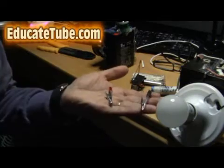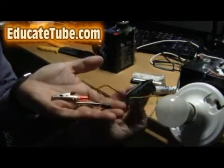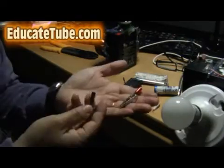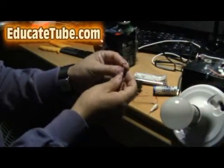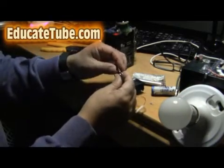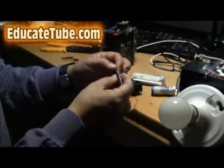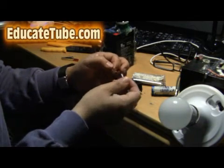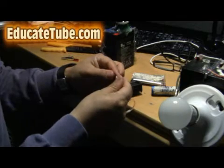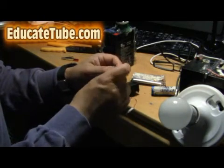So here's the clip terminal that I will provide. I'll provide it with the module and you can put it together. What you want to do is align the negative wire with the black terminal and then — take this plastic tube out — at the end of this, I recommend you solder it in. It's probably better to do that. I would definitely recommend soldering because if you just clip it in like this it will not hold very long. So I will solder this in later on. Using a wire stripper, press onto the wire.